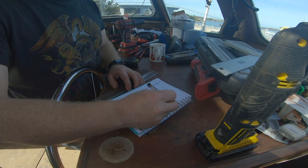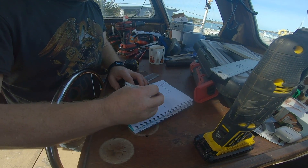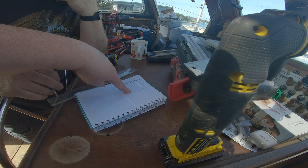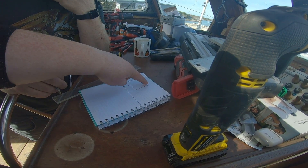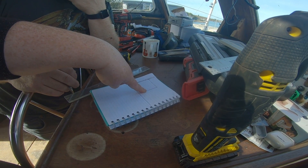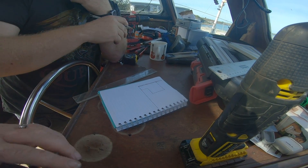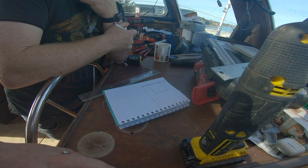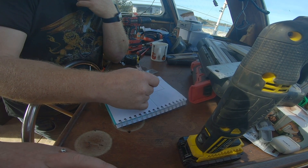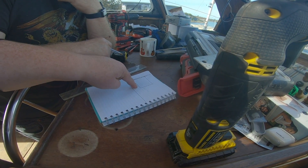We'll make the box — the piece to go in the floor will be a removable box. But we need to work this measurement out by working out what height it needs to be for us to sit on. We've just done that by sitting on those boxes. For our feet to touch the floor. Once we've got that box in place, we'll then work out how high we want the floor to be, which will tell us how deep we want to make this floor box.